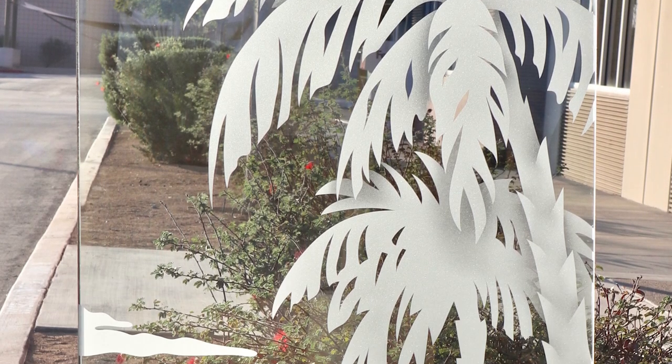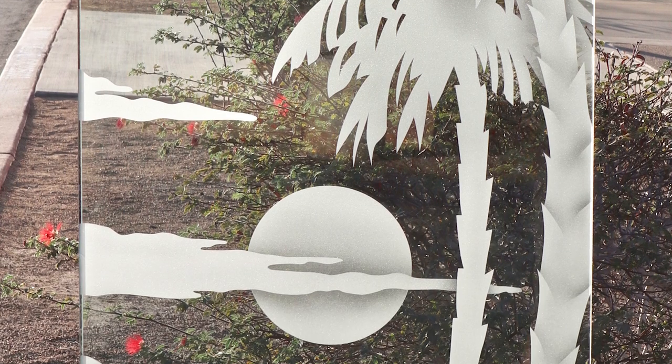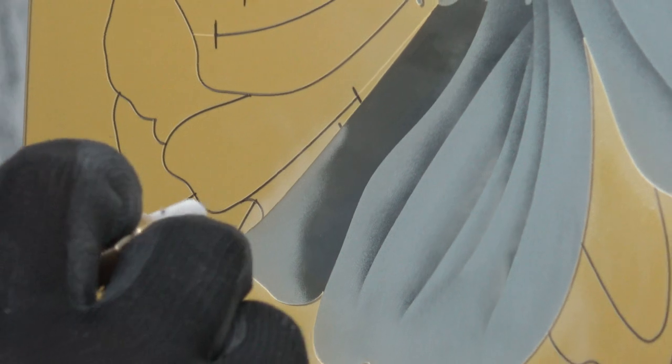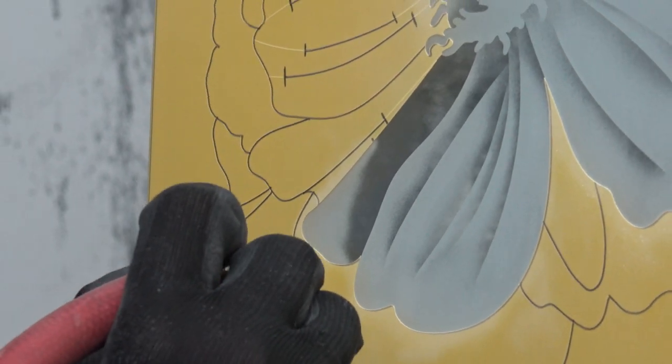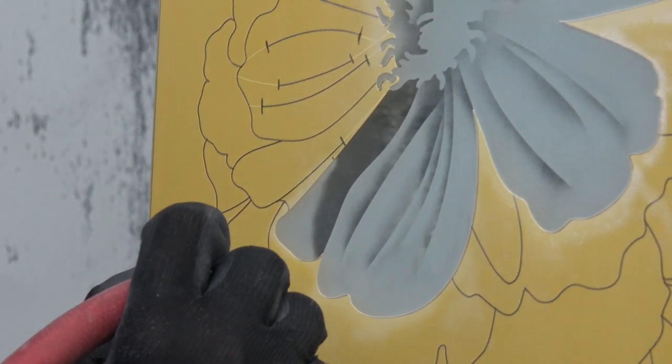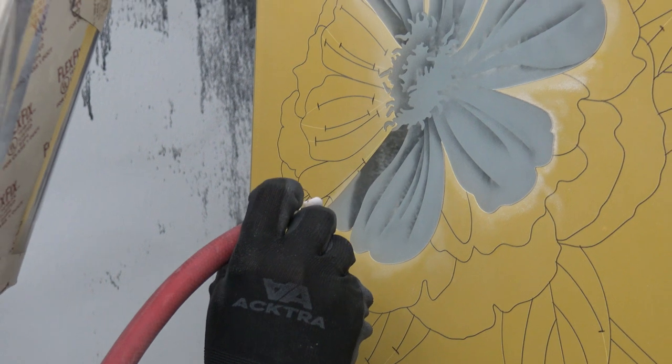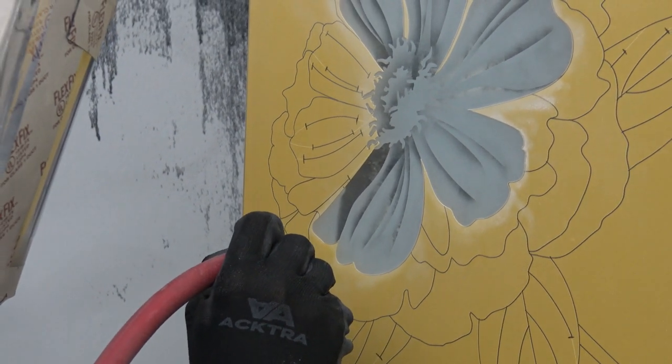With 1D, the artist etches the glass overall across large sections, much like when you spray paint with a stencil — far different than the staged sandblasting and intricate work of 2D and 3D enhanced, where the artist works on one small segment at a time. With 2D, the artist implements shading where the sandblast density gently fades out to clear glass, creating a gradient-like effect that adds a high level of intricacy and detail. Each shape and segment is individually etched with a gradient, but without the carved edges seen in 3D enhanced.